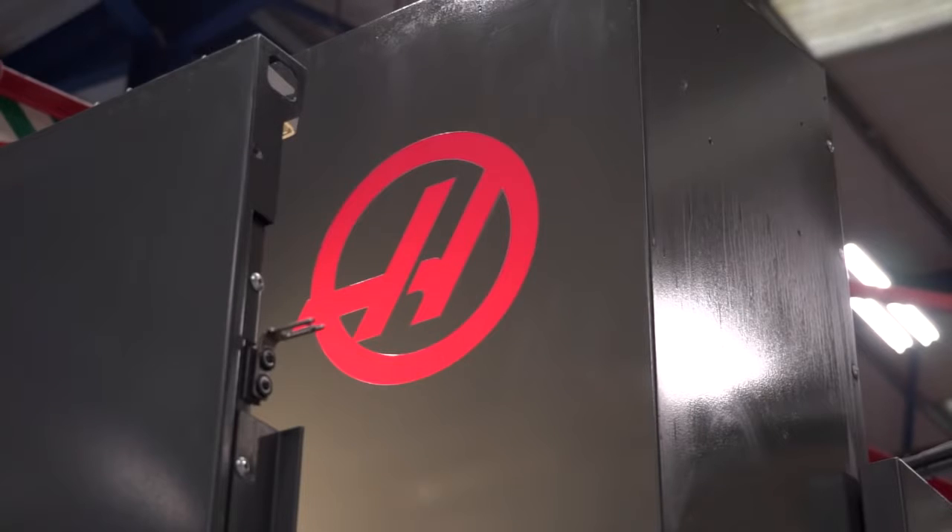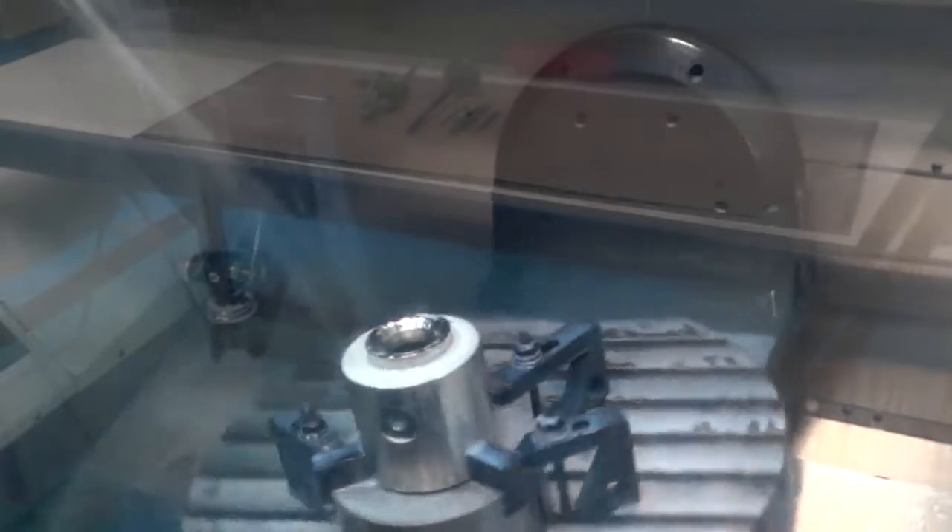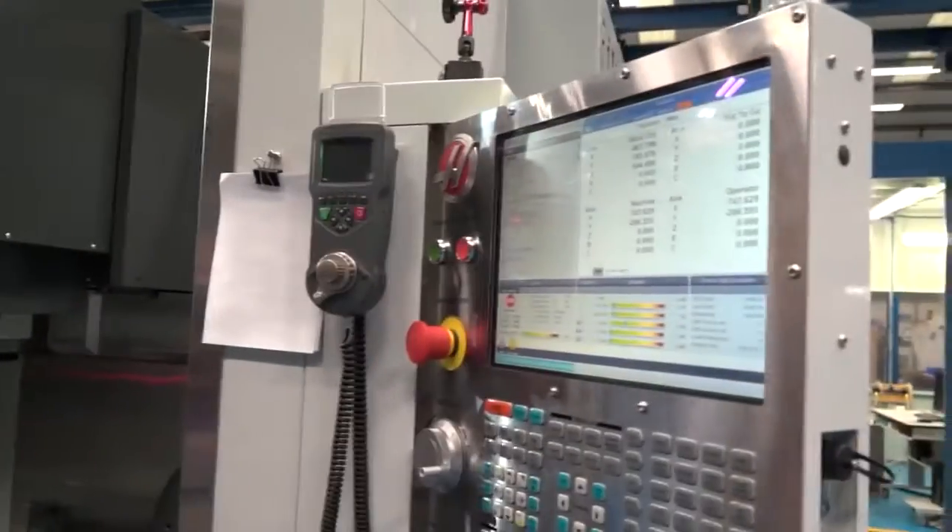One of the components on the second UMC you bought is made from a pretty hard stainless steel, so when selecting a machine you must really look at what it can deliver not just in the short term but in terms of long-term accuracy. The majority of the parts we're asked to supply are manufactured from stainless, super duplexes, Inconels, titaniums, as well as softer materials such as aluminium. We are seeing an increased demand in the complexity of parts — prismatic machining is something we've been involved with for a number of years — hence why we've brought in our second five-axis HAAS.